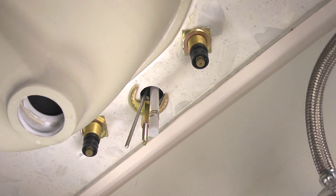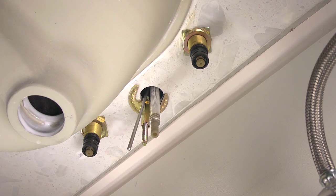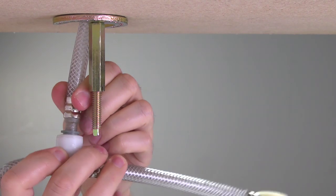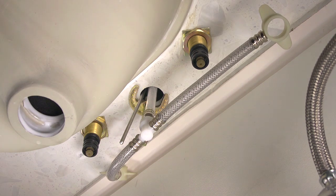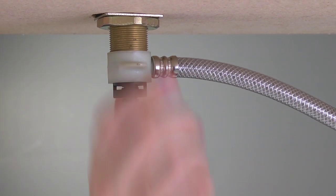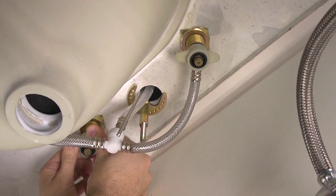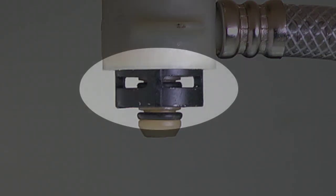It helps to have someone topside to make sure you're tightening it on straight. Now install the hose connector that connects to both the water supply receiving tube and the hot and cold valves. Be sure to remove the protective cap on the water supply receiving tube before installing the hose connector onto it. Push up onto the fitting and then check to see if the inner collet separates slightly by pulling back down on the center connector. If the faucet does not pull off the receiving tube, your connection is secure. Push up hard to ensure a secure connection between the hose connector and the valve body, keeping the alignment straight and being careful not to damage the O-rings. When installed correctly, you should be able to see the window on the valve body.